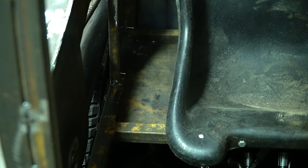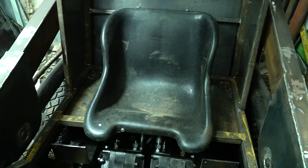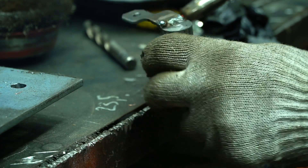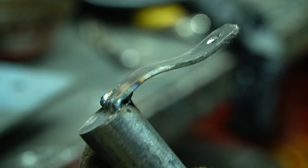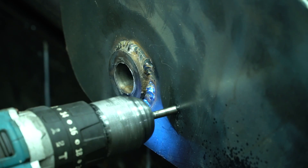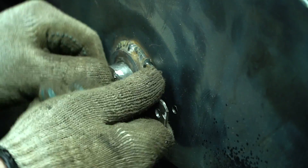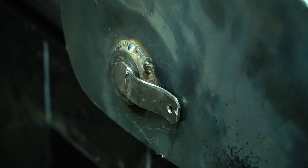I also concealed the underside of the cabin under the seat. Then I turned to the pins of the hydraulic cylinders — I welded plates to them to protect them from turning. They don't need any grease nipples since there are eye bearings in the clevis and grease nipples are already installed on them.